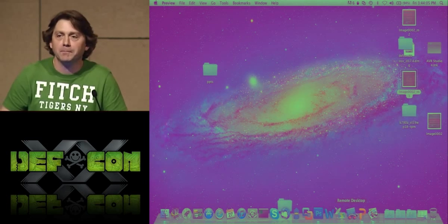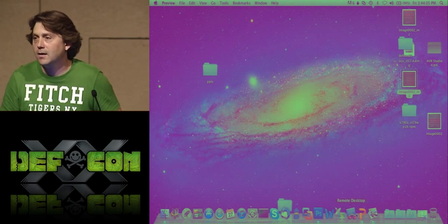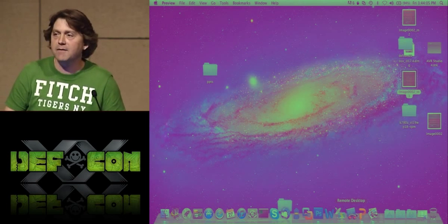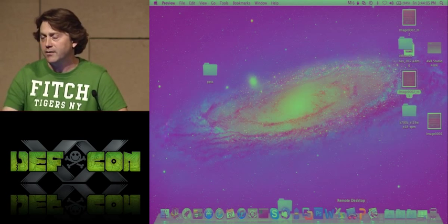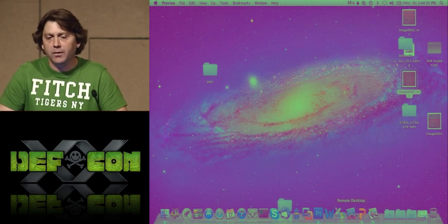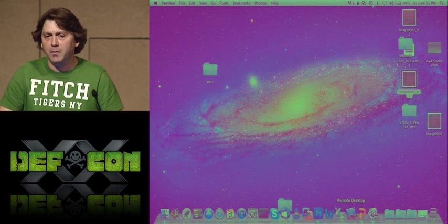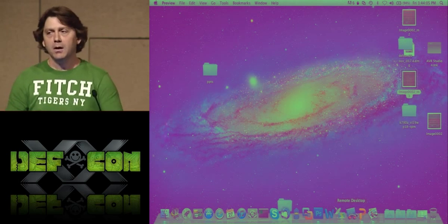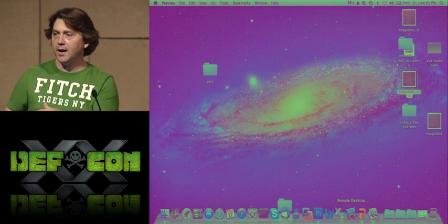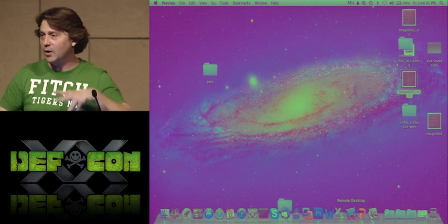45 nanometer. Yes. What is your success rate with an individual unit? I have over 400 samples of this chip. They were like 20 cents on Hong Kong inventory surplus. So once I burn through whatever I need to do my initial analysis, my success rate is going to be 100%. Unless something catastrophic happened, like I wasn't eucentrically level in the FIB, and I stick the needle in, and it wasn't 100 microns above the surface, and I scratch it.